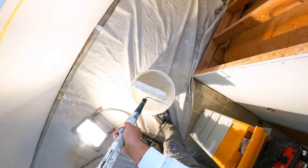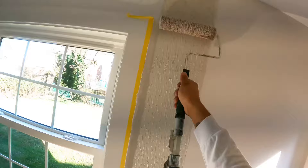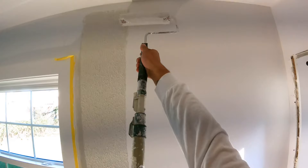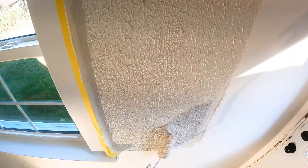What you're going to do is just dip the roller, shake off the excess, and all you're doing is rolling it down. Take another one, dip it in, shake the excess off. I like to start near the ceiling so you can work it down and then push it up, so you have an even spreading of it. Just work and make sure you have an even, uniform application.